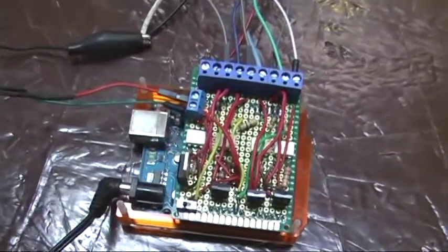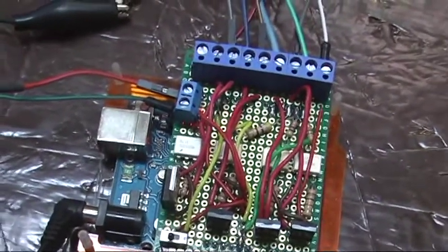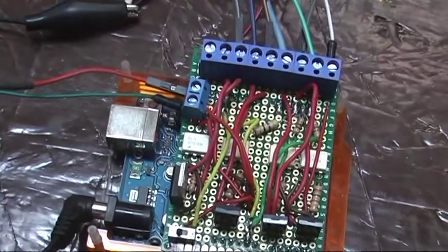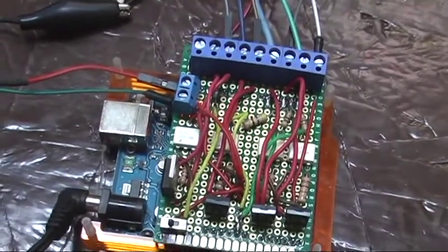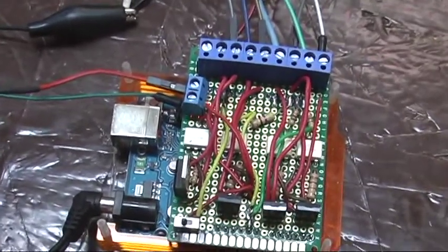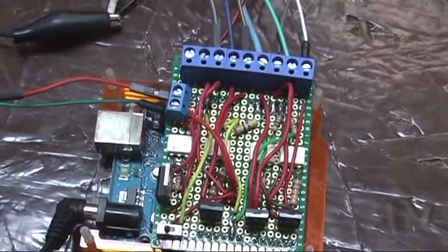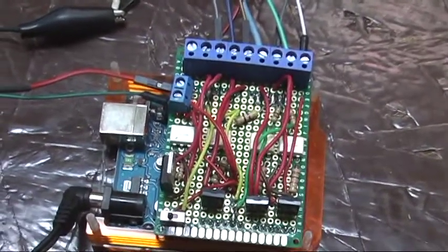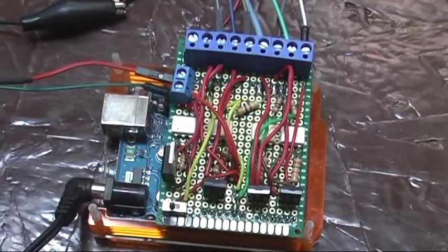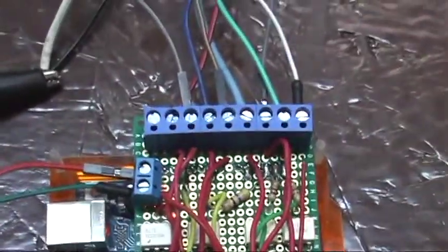Through the RS-232, I'm going into a software serial channel on pin 6 to transmit data from the command base to the Uno. I do not use 0 and 1 for the onboard serial. I leave that so I can use that channel through the USB to the computer to do any diagnostics I have to.